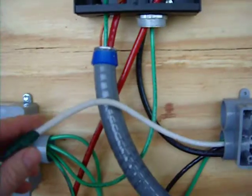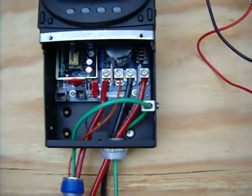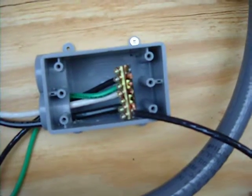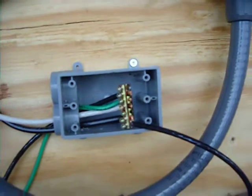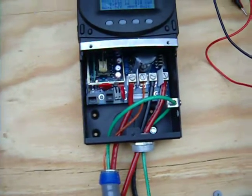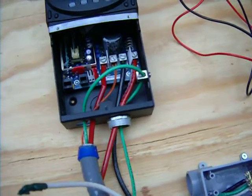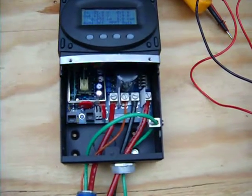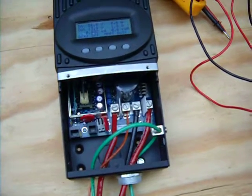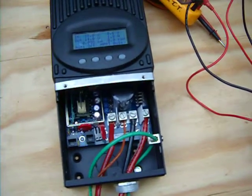There is the question of this wire — whether or not it's on the 12 volt battery system. The reason we're a little bit confused about that and went with an independent negative bus on the PVs is because our thinking was the diagrams from the Outback technical installation guide basically depict a 24 volt battery system and a 24 volt PV array.